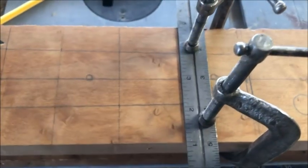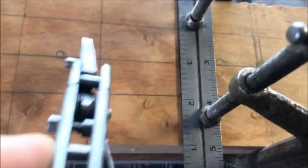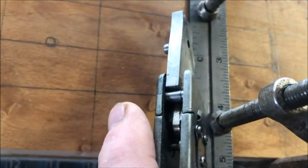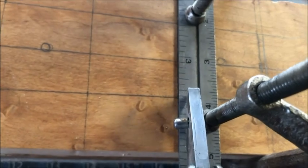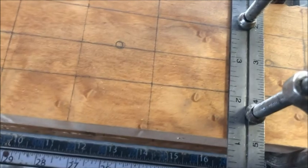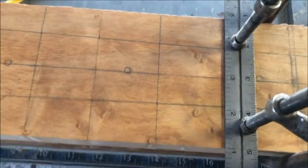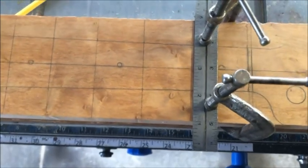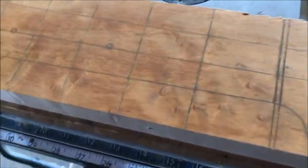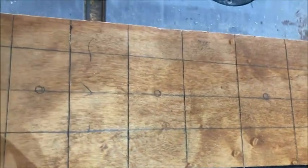Here's an idea. Put a straight edge or ruler on the fret line and score it first with your trusty little razor blade. Hopefully, that'll keep your trusty fret saw from wandering. Once again, with a sharp tool and a dull mind, there's nothing you can't accomplish.